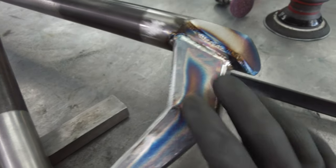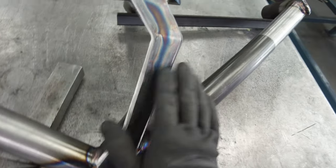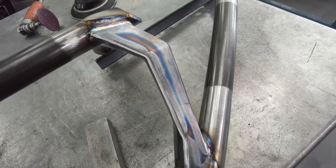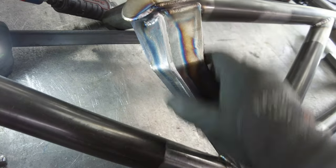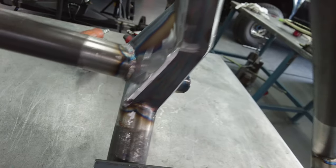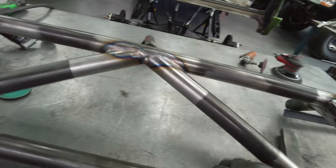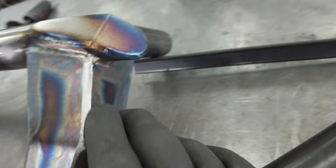Step one, beveled edges. If you can get a visual on that, it's just a 45 like we talked about. So top surface, side surface, and 45 bevel. And that's on both sides. There's not really a lot of fall off on the weld where I need to get the sides. It was only here. But everywhere else is smooth.